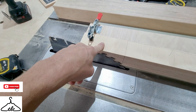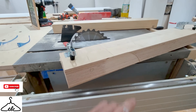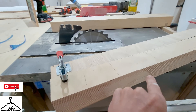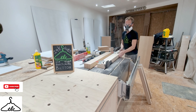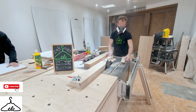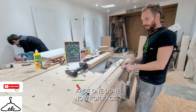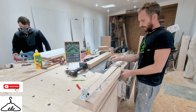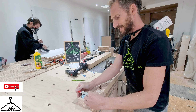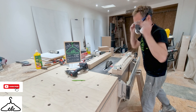So I've got face one up. I've done a little test run and we are a little bit short of the line but I'm happy with that — I know my saw is cutting to my line. We've got a little bit of a problem because this toggle clamp isn't going to be at the right tension, so we can put a little packer in there to take the slack out with a spacer. There we go — just used some 3mm spacers. Let's go for it on the second face.